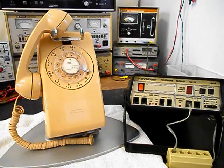We want to go through the rotary dial. The rotary dial is sluggish, so we want to clean, oil, and adjust the rotary dial and make sure that all of the numbers are dialing properly. We want to go through the network and make sure that all of the connections are proper and tight.